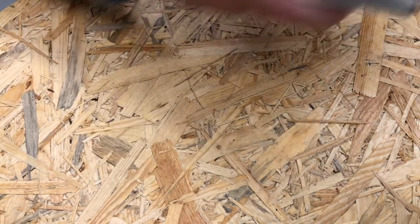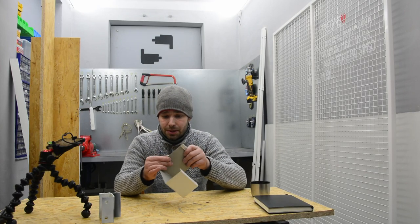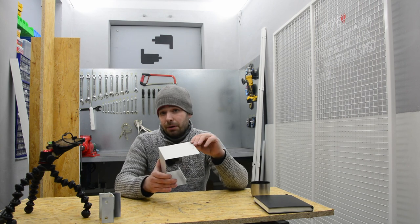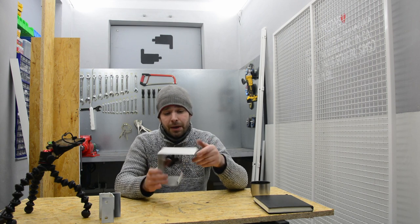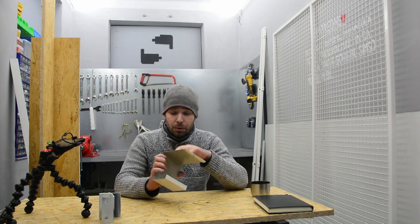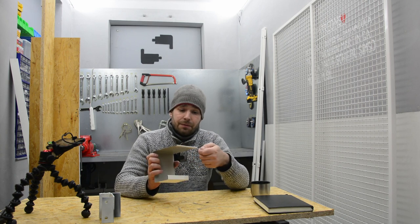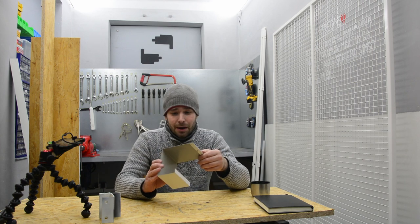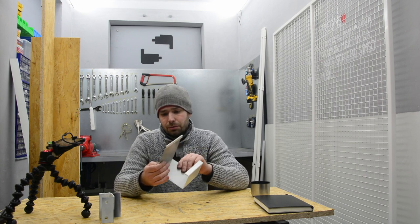And I think it looks nice. I was able to bend it without many scratches. I still have to put some masking tape on the mating surfaces, so this will just slide over. The sheet metal comes with a plastic foil, so all the machining and bending you do with the foil on, and then you have the satisfying moment of peeling the foil off. I hope that I won't get any scratches, because it will be hard to repair.